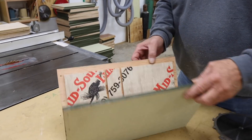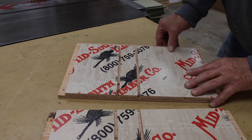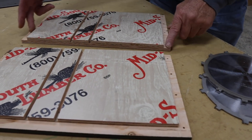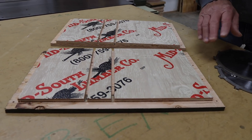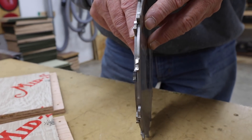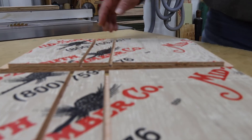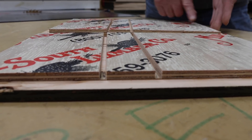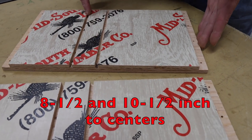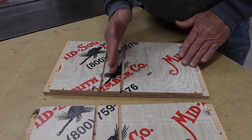So this would be a front and back. We leave the dado set at the same depth — these grooves are the same depth as our dados around the side. I take all the chippers out and just use the two end blades, and they make exactly a quarter inch when stacked together on the table saw. The first groove from the edge of the board to the center of the groove is eight and a half inches. The second groove is ten and a half inches, and that gives us the perfect dimension for putting that isolated frame in there for the queen.